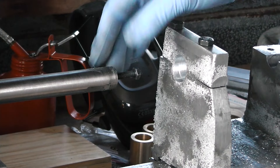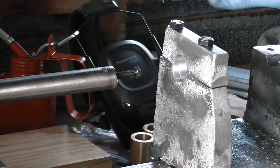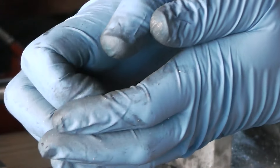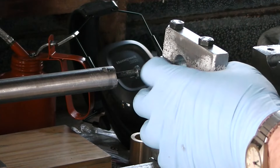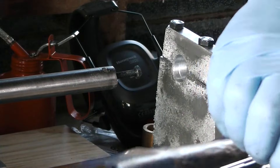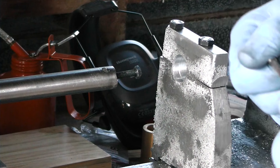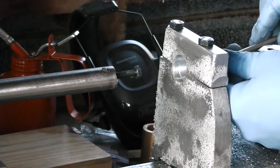Lesson learned. I adjusted the cutter so it has a slightly more rounded tip on the actual cutting point instead of just a spike — rounded it a little. It seems to be cutting better. This is what I originally bought these snap gauges for; I didn't originally buy them to check the calipers, but that's where we got them first.